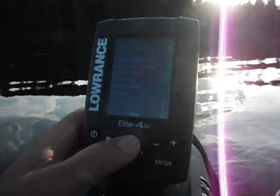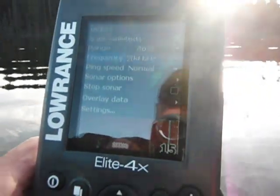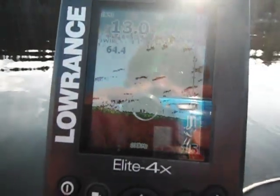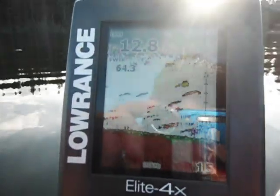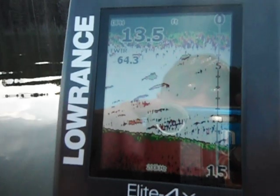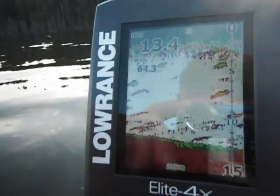Right now I'm at 200 kilohertz because I'm fishing pretty shallow — about 10 feet — so that's a more effective frequency to be scanning on. You can see how granular the display is; I'm at about 13 feet and you can see various bars of stuff in the lake. This is actually a very popular lake in the Nicola Valley — Roche Lake — we come here a lot, and there are a lot of fish in it. You can see the bars coming along here.